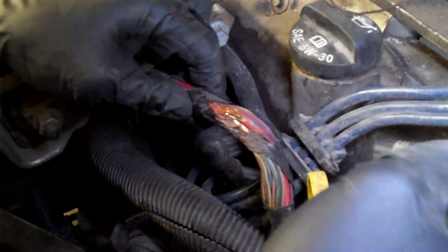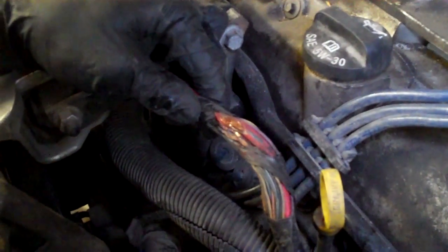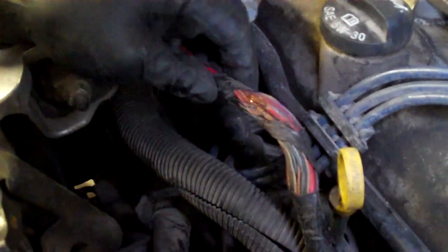33.2 millivolts isn't a common signal you'd find on all wires, so that confirmed the short. We went ahead and opened it up and started patching the wires one by one, color by color — and we do have a fix. That is one happy running van now. Thanks for watching. If you want to see more videos like this, click subscribe. If you like the video, click like. If you learned something, leave any questions in the comments below.